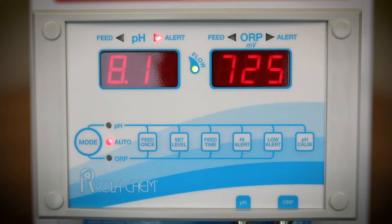Do this by testing the water chemistry. Adjust the feed times to correct the chemical balance. Remember that too much chemical, you want to shorten the feed time. Not enough chemical, you want to increase the feed time.